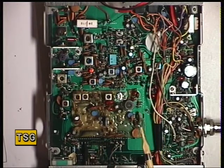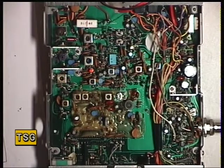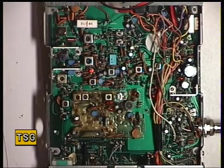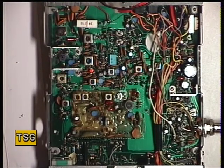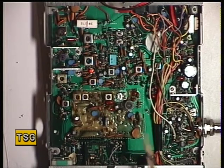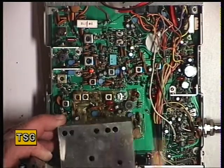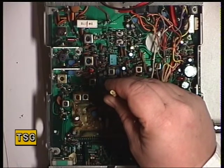We'll check the deviation — get the oscilloscope out for that. Using the oscilloscope we've got two and a half, which is what we should have. Check with the whistle test — wallow just a fraction. I think we could do with a touch on that, and the deviation preset is through the screen — it's the second hole. Wallow — there we go.